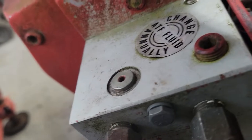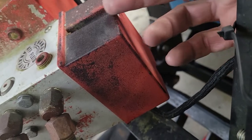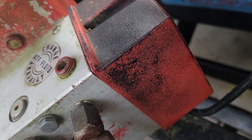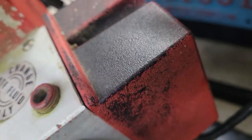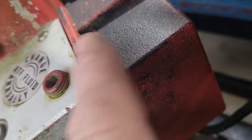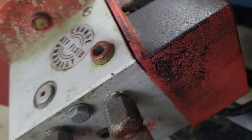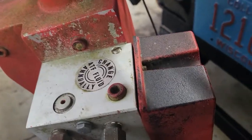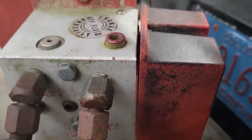That's what I found out — there's three. I had this cover off earlier; I should have left it off. There's three solenoids in here. But there's another valve that looks just like the head of that. Changed that one out too, because it would go to the right but wouldn't go back left. I changed that one out — I didn't realize there was another one back here. So change them both out and it'll cure your problem. If anybody knows how to make the blade drop quicker, release the pressure, let me know in the comments. I think it might be this valve here. Anyway, have a good day.